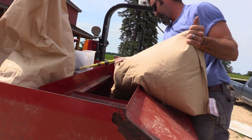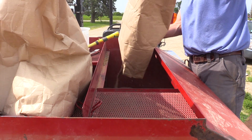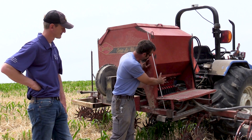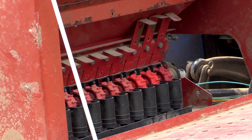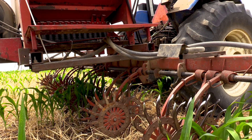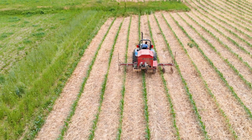How do you disperse seed through it? Seed is put in the top of the box — today it's about a 15 to 18-way cover crop mix. This is a hydraulic-powered fan blowing through the hose to the diverters. There are meters in here with wheels on them that are metering seed when I turn it on, and the air is forcing it out the hose, dropping it down behind the rotary hoe units. I touch very lightly with the rotary hoe — more so in corn stalk residue to stir it up a little bit — but even today we're picking a little dirt and moving some of this rye straw.